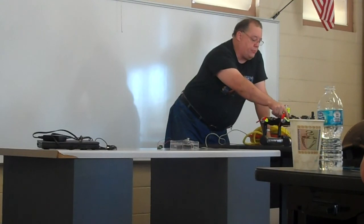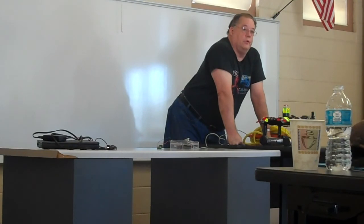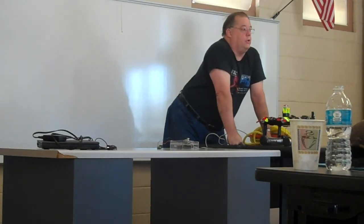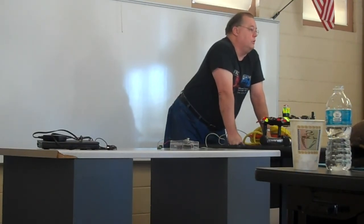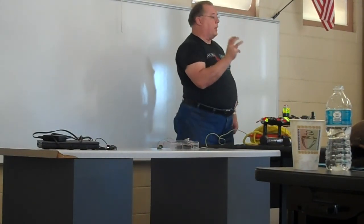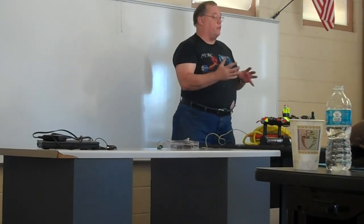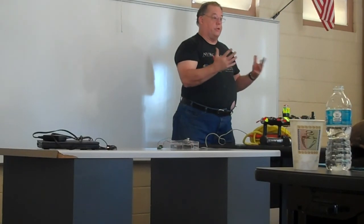So, in order to mount the motors, once again simplistically, the pipe extends a little bit more. I cut it in half and I get a little saddle. The motors are just taped in with black lipo tape. Once again, not good for years of operation, but very quick and eliminates the problem of zip ties, which, even if you trim them properly, have that nasty square box with all those nasty sharp edges that, after you've been working in the pool and your skin has gotten soft, very easily can cut your knuckles.